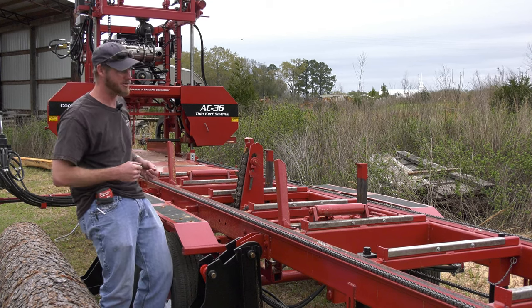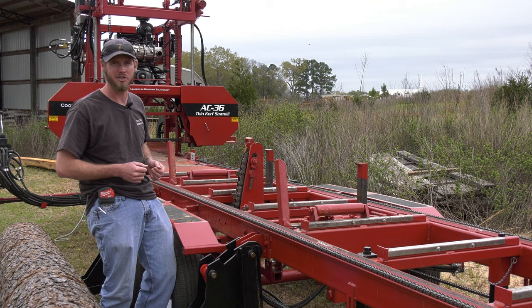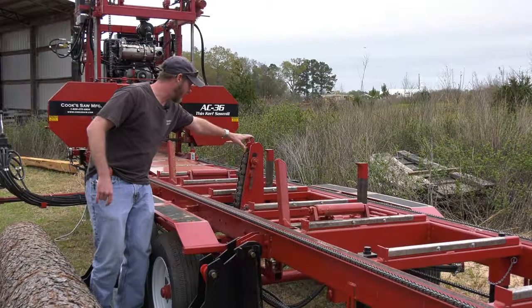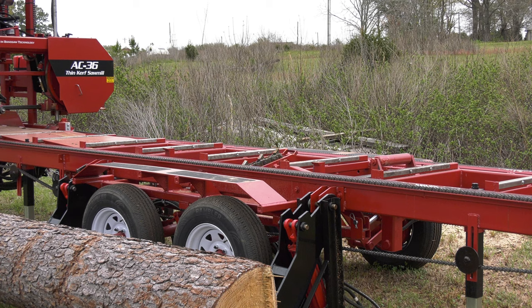So several uses that we like to see out of our tapers, but they are operated with a hydraulic cylinder and then a lever to control them. And they do move independently on our tapers. Our log turner, this is where our power is. 120 roller chain on the turner, very, very heavy built, hydraulic cylinder pivoting it up and down. There's a hydraulic motor that is rotating it.